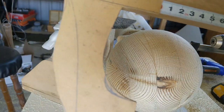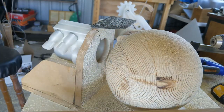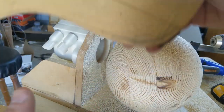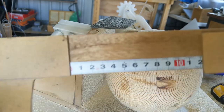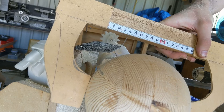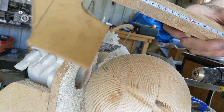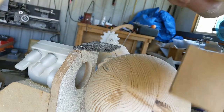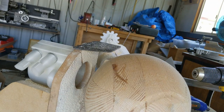Now to measure that, I have these giant calipers that I've made. They are essentially just a stick of wood with some 3mm MDF. And then I have here just another piece with a straight-ish edge, and you can buy these metal stick-on tape measures. Really nice. Now these calipers are surprisingly accurate - to the nearest millimetre anyway. The target is 160mm and we're at 162mm. So actually this might be mostly gone by the time we get there. We'll see.